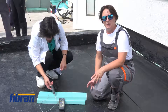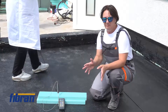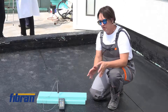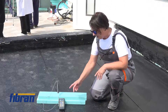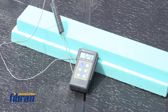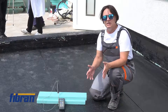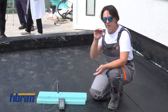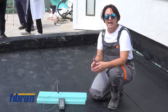One of the reasons why we prefer the inverted roof system is to reduce the temperature difference between summer and winter on top of the waterproofing. The black waterproofing gets very hot in summer — we are measuring right now and it is rising over 50 degrees Celsius. If you consider that in winter this temperature can drop as low as minus 20, that is a very large difference which causes premature aging of the membrane.